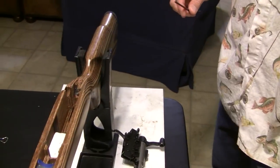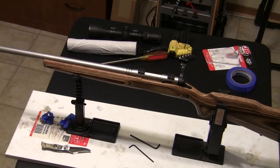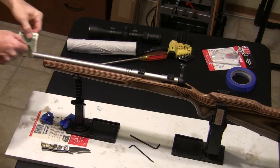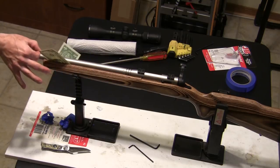Hopefully that'll be it. All right, well, the left and right of the barrel and the stock did not hold. It's not completely mashed on the left edge, but as you can see, it definitely is riding the left edge. B-Mag just loves that left edge. Well, check this out. It's closer to the left edge than the right edge, but right down to the bedding. So the bed job went really great, and off to the range I go.